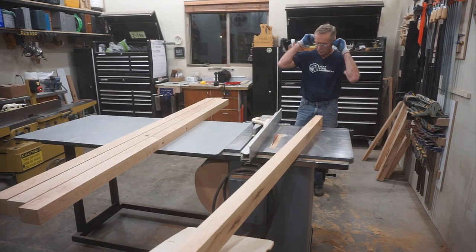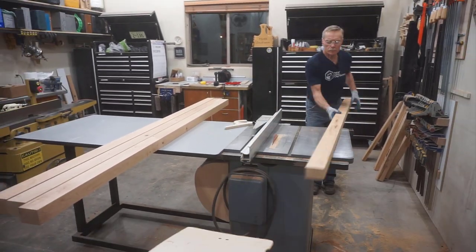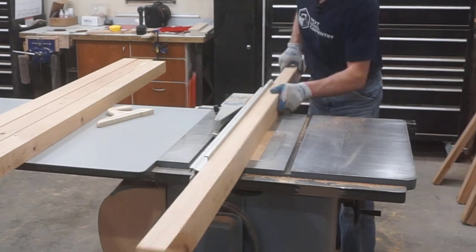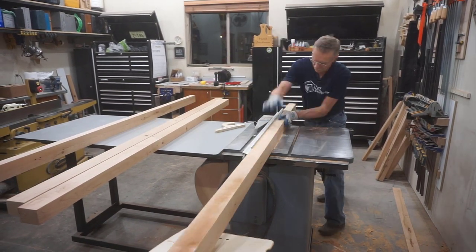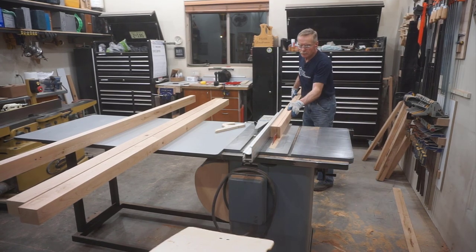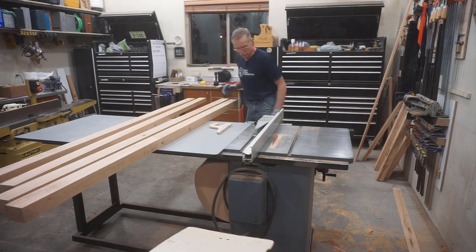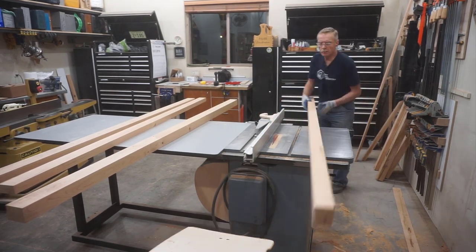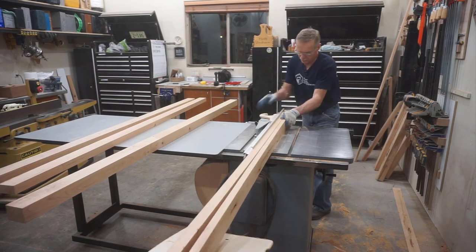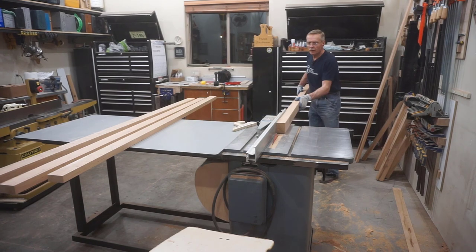Hanging doors is usually thought of as general carpentry, but making doors, in my thinking, is advanced carpentry. To do it effectively and efficiently, it takes some pretty serious equipment, sharp tools that are well tuned up, with plenty of power to make robust cuts in high-grade materials. On lesser equipment, making rips through pieces of solid hardwood like this is beyond the capability of the machine. But with a good grade cabinet saw, a clean sharp rip blade, a steady feed rate, and a steady hand, this is pretty much routine for a door making shop.